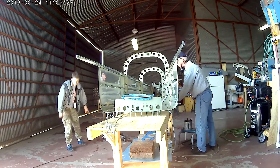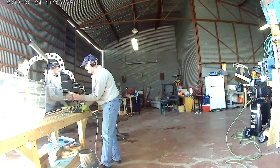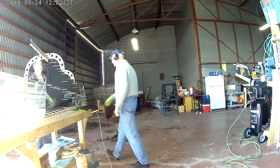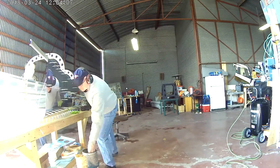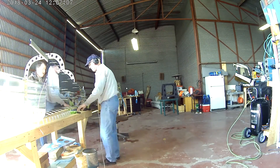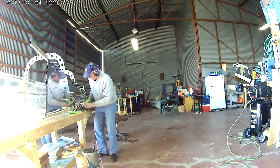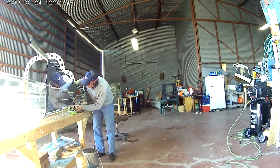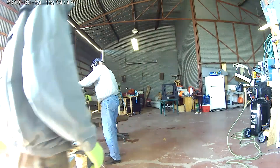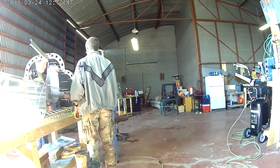Vans has this thing so tight the only way something doesn't fit would have to be some kind of atmospheric phenomenon. The one pain in the butt is trying to get to the rivets at the bottom — where the side skin meets the bottom skin it gets a little weird. You have to tilt the fuselage on its side, so you have to make sure that the other side is amply cleco'd in place first. I do apologize for the horrible camera angle.